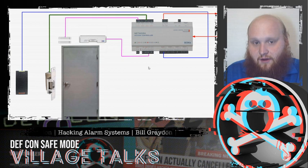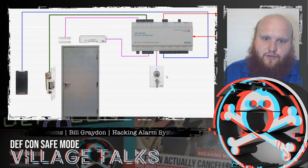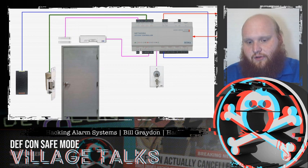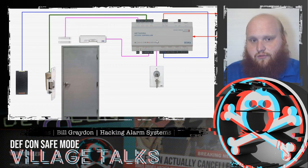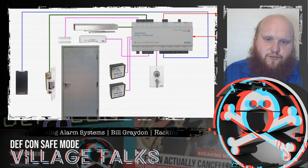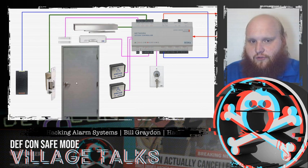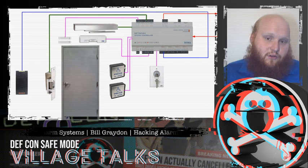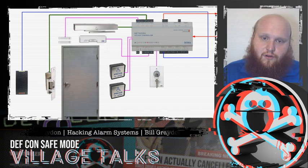This is the general setup needed at a bare minimum for an access control and alarm system. We can add peripherals such as a mechanical key switch that can be used to lock or unlock the door for public building access hours — it allows someone with much less training to actually lock and unlock the system. We might also see accessibility features such as buttons that trigger an automatic door opener. The button on the outside will only open the door if a credential has been swiped validly or if the door is supposed to be unlocked during public building hours.